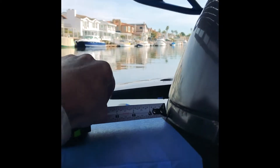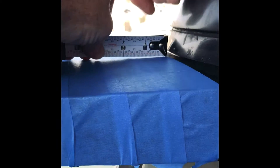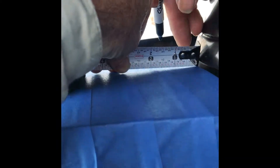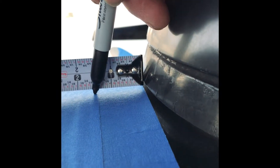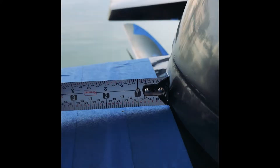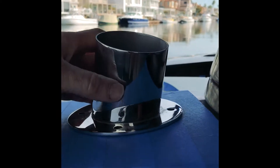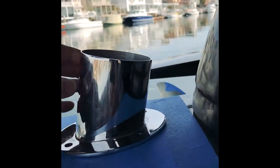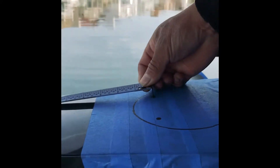Right on the blade it's exactly a quarter inch. We're going to show this drive from the beginning. We've got some blue tape here on the drive — we're going to place it exactly at one and a half inches, making sure it gets right in the center. Then we're going to get the top piece on here, centered, and get the center point between the top of the drive and draw the four holes.